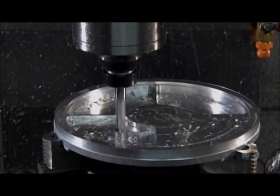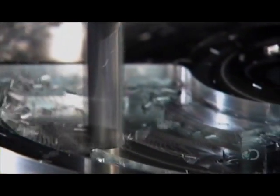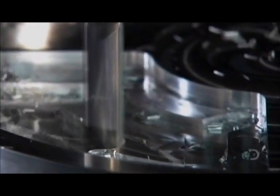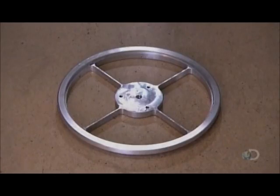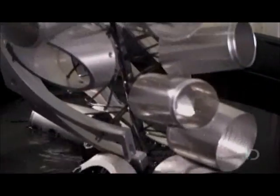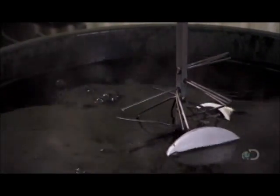More tools transform a solid aluminum disc into a ring with spokes. This part, called the spider, is a framework for supporting the telescope's secondary mirror. After coating the metal parts with a protective oxide, they plunge them into a vat of black dye. The dye soaks into the oxidized pores and seals the surface of the parts.